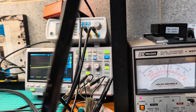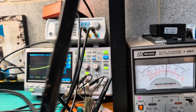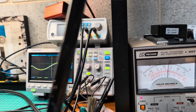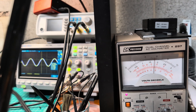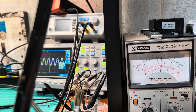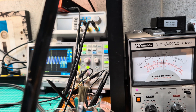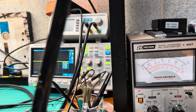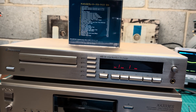30 Hz, 40, 50, 70, 150, 400 — very linear. 700, 1,000. Let's see if it will be more even than the Nakamichi. 2,000, 3,000, 6, 8, 10, 12, 13, 15, 17, 20. It was a little bit more linear than the Nakamichi, but the difference of about 0.2 decibel is not worth talking about.